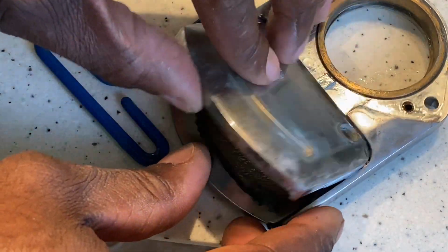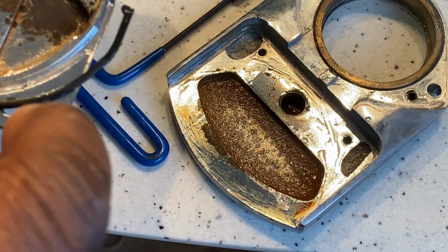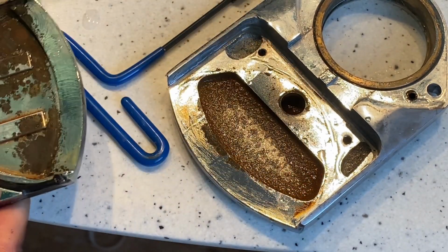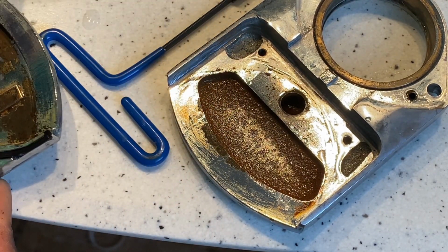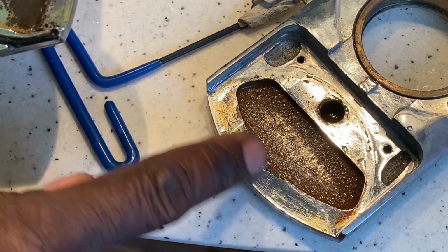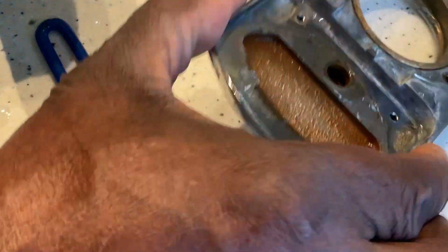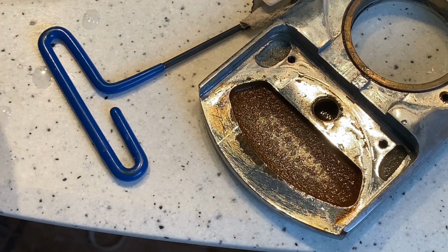We'll take it off. And this rubber piece right here goes right up in here. So it may or may not come off or fall off when you do it, but it just goes right back into here. I haven't found a replacement part number for that yet, that rubber piece. And then this is the other end. So really any reason why water will not come out could be a buildup around here. Could be a buildup around here. Oops. Around in this area. So you want to check those out, clean them all up just to make sure.